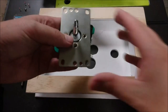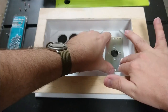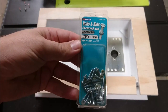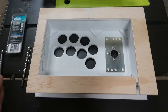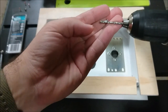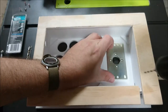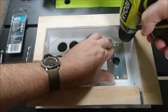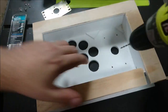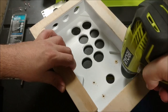The last bit of woodworking left is the mounting of the joystick. To more easily line up the screws, I've taken the plate off of this Sanwa JLF to use as a template. The bolts I'm using are these dinky guys I found at the hardware store. While you can get a set of bolts bundled in with your joystick purchase, these are significantly cheaper to pick up. The holes we'll be drilling should be just bigger than the diameter of the screw — it should pop into the hole but not wiggle about. You can fuss around with measurements to align your joystick perfectly, but a degree here or there never really affected anyone when it comes to a digital joystick. A good eyeballing should be good enough. Just because of the awkward camera placement, I partially drilled the holes before removing the template and finishing the job. At home you can probably just do it all in one go.